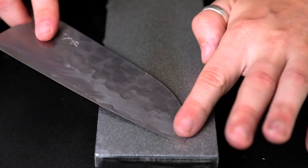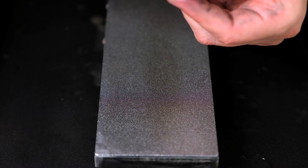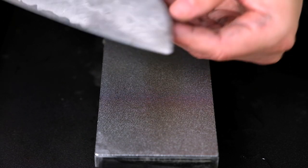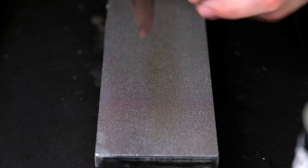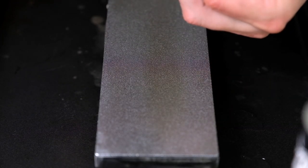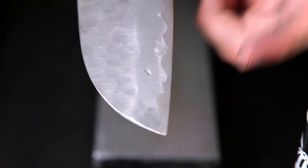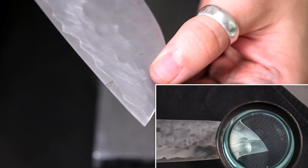There's one more skill in the knife knowledge knife bag. Now of course we'll want to polish this. The spine isn't as rugged as I thought it would be, especially using an Atoma 140 stone. Are we satisfied with the tip? We can probably refine it just a little bit more. I'm working on this now for about 30 minutes. I'll do some refining touches and show you the final product. Just a few light final strokes now that we've created a new tip. We were able to maintain nice acuteness to the spine - I didn't want it to be too round because then the tip becomes useless. So we have a nice sharp tip.